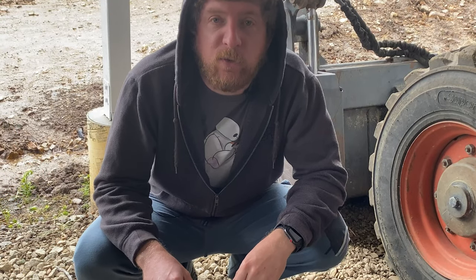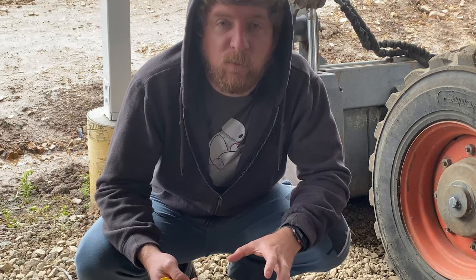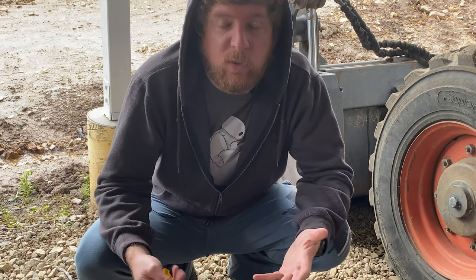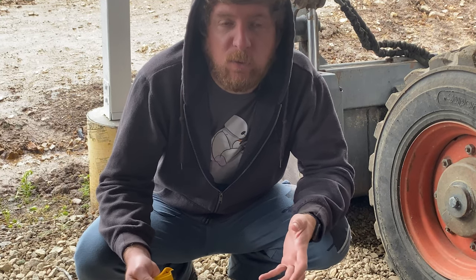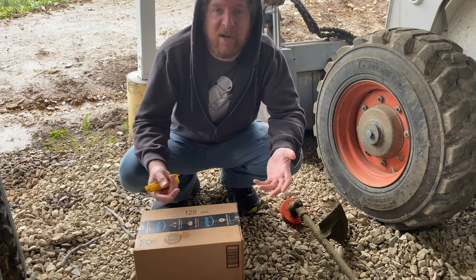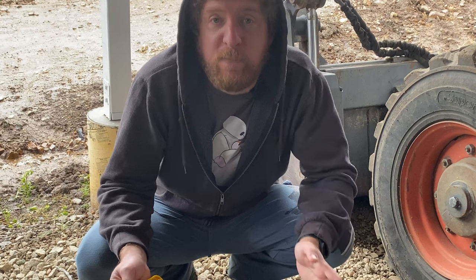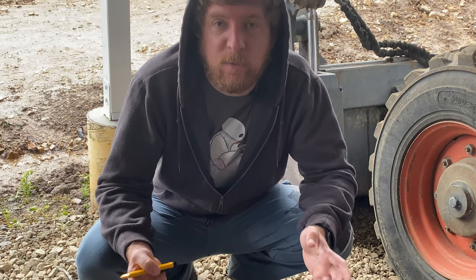All right, so something that I noticed a little too late is there are a couple sides on this gearbox that have been rusting. It's relatively new, just a few months old, but if you don't protect steel surfaces, they rust and it'll just get worse and worse. Granted, it may not ever get too bad, but who knows 10, 15 years down the line how bad it could get. I should have noticed this when I had all the bearings out. It would have been real easy to just paint the thing, but now that I got the bearings and the seals in, I was like, oh, I really should have treated this. I'm gonna just do a best effort paint job on this thing because it doesn't really matter as long as you get something on there to protect it.